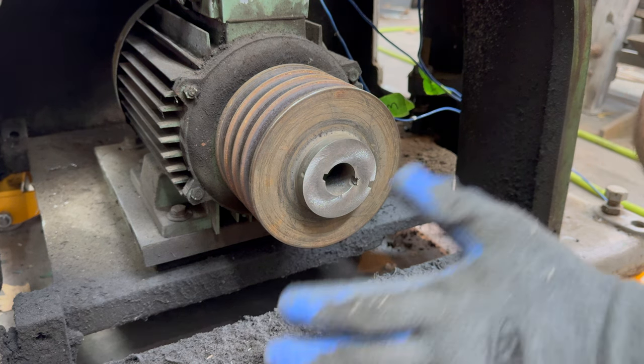The brush-on stripper was working just fine, but I noticed they also had a spray-on aerosol version, so I thought I'd try that one. It's a little stickier and seems to adhere to smaller parts a bit better than brushing it on. I also noticed when reading the SDS that it has quite a bit of acetone in it. This is basically the brush-on stripper, but with acetone as the carrier solvent. So that got me thinking, could I add acetone to the brush-on version and then make my own spray-on stripper?